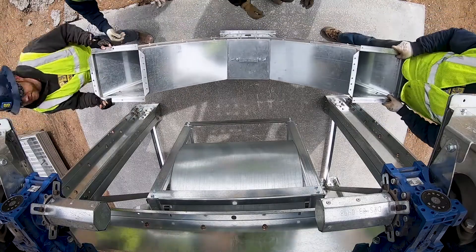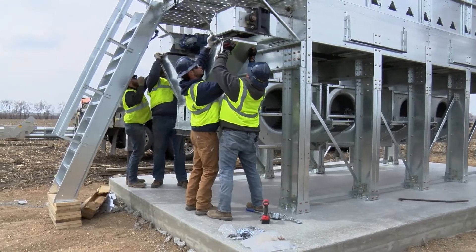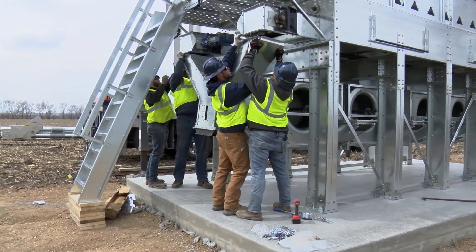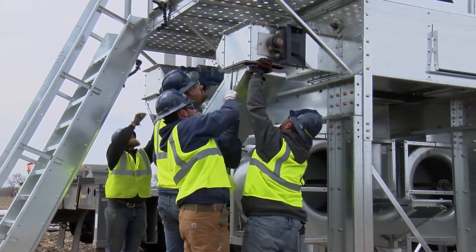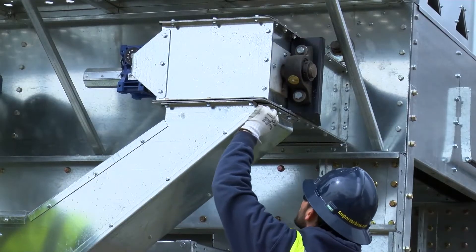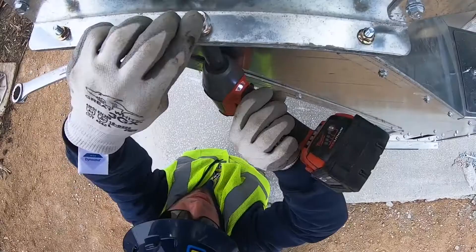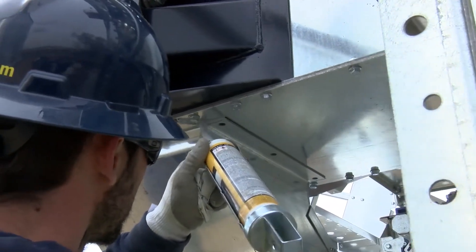For the two to one discharge, get it into position under the two conveyor outlets and using safe lift procedures, have a couple guys lift the assembly into position and guide it with punches. After getting a bolt in on each side, the discharge will be able to hang safely. Install the rest of the bolts in the front and the sides of the discharge. The back does not need to be bolted. Use silicone to fill any gaps in the discharge assembly.